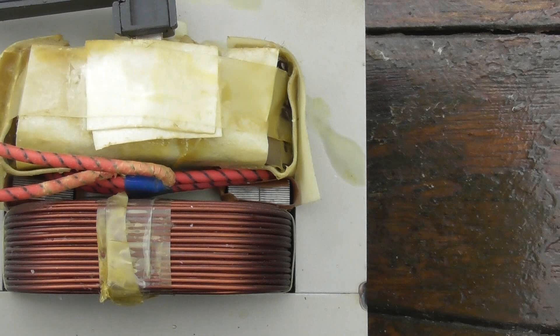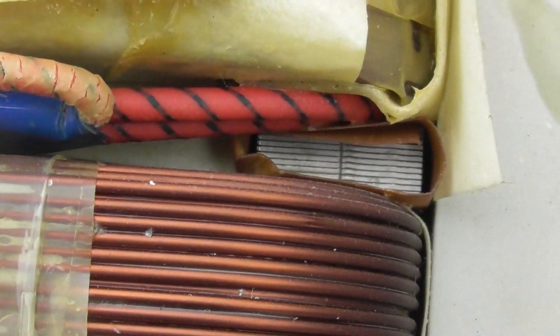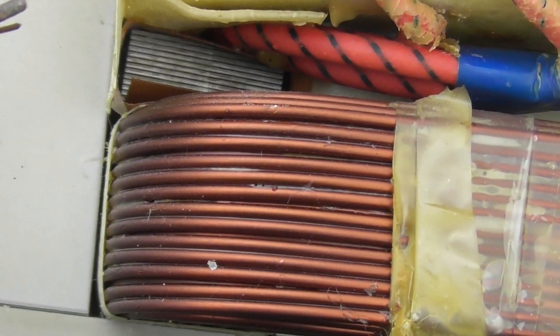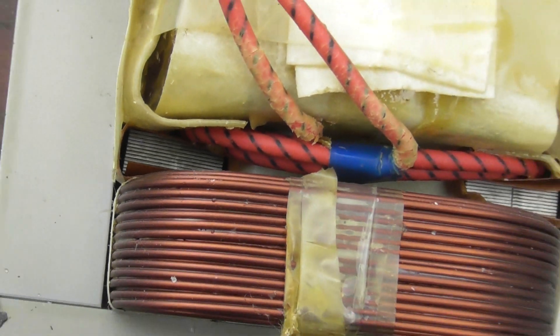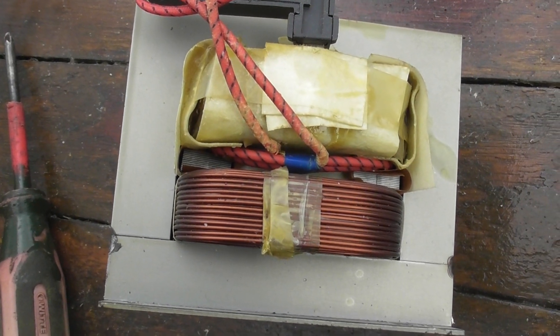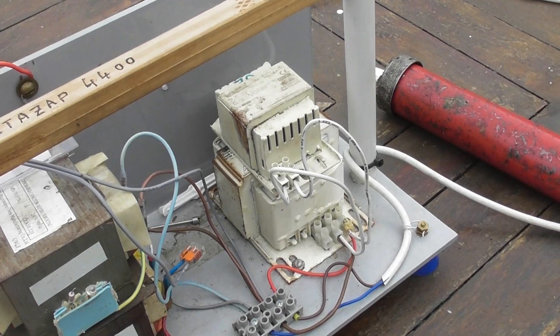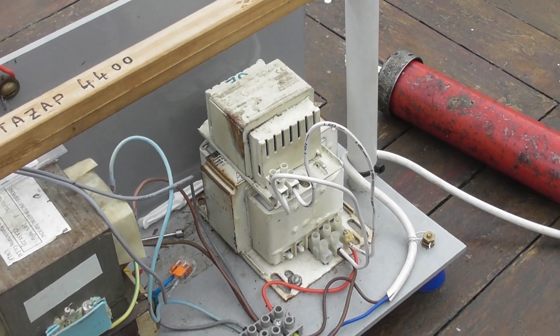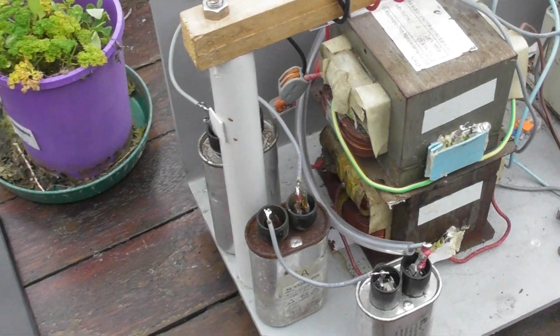As I said on the Wasp Zapper — look at these shunts. They cause a high resistance path. The shunts are these laminations here, and on the other side too. If you leave those in, the transformer has higher leakage — same as a welding transformer when you apply a shunt to reduce the current. If you knock them out, the transformer has a lot more power, but it will go up in smoke very quickly, so you need to limit the current. For the Wasp Zapper I just use a couple of ballasts — streetlight ballasts. You could also use fluorescent ballasts, though they're smaller, so you may need to put a couple of 80-watt ones in parallel to get the current you desire.